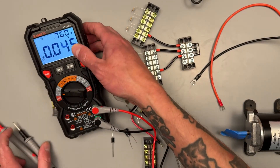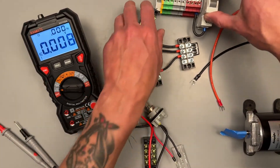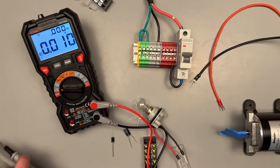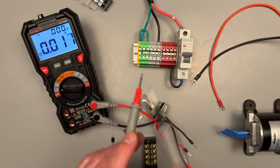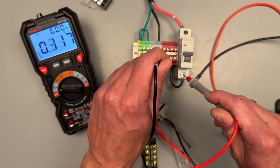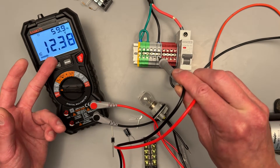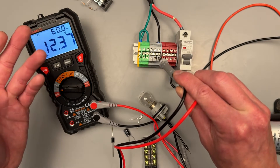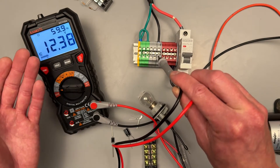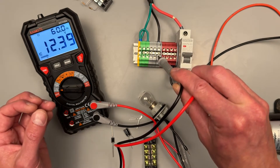Hitting the function button takes us to AC measurements, which is like the power that comes out of your wall. I've got a little AC power source here to take a measurement with. For AC it doesn't matter which way you use your leads, but I always like to keep red on hot as best practice. We have not only our voltage display for the AC measurement but also our frequency — it's showing my alternating current source is at 60 hertz and 12 volts. That's pretty nice, especially useful for motors or variable frequency applications.